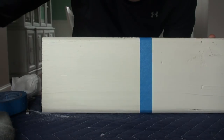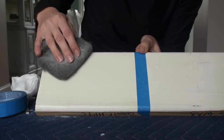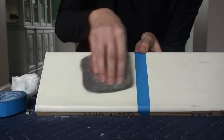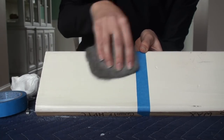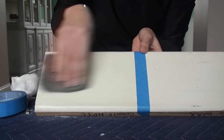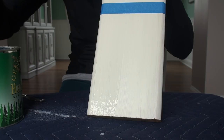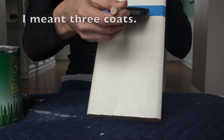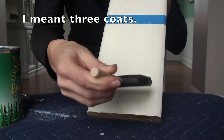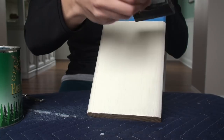We've got our wax on and our top coat on — I'm going to let them dry and check back in a little bit. The dry time on the General Finishes top coat is two to four hours. After that time, I'm taking fine triple-zero steel wool and just roughing up the surface a little bit between coats, then adding a second coat using the exact same technique as the first. General Finishes recommends doing at least three coats of this high performance top coat; I'm just doing two today to save time, which should still give us a good idea of the finished result.